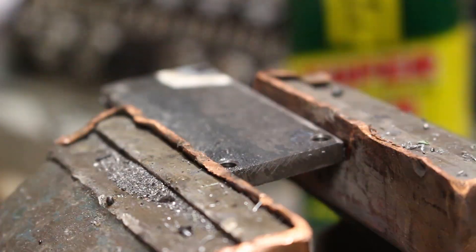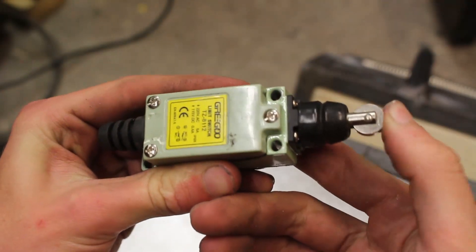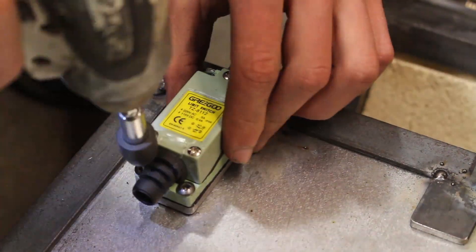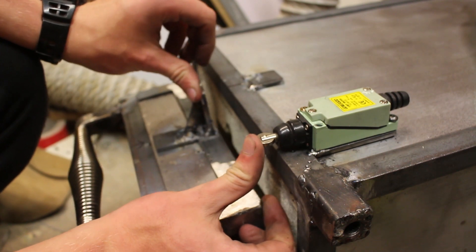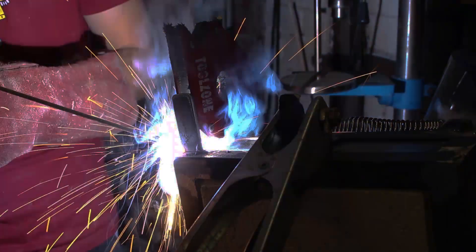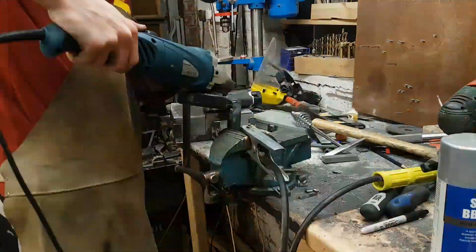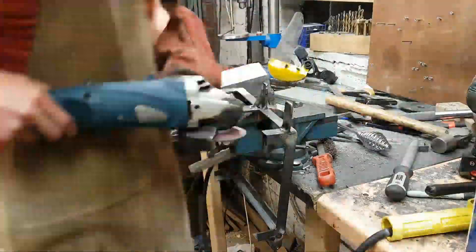I tap this piece of 5mm sheet steel with some M4 holes and weld that onto the side. This is actually going to be a bracket for a limit switch which is going to act as an interlock for the door, so that when the door is shut the power is on, and then when you open the door it turns off the power to the inside of the oven, lowering the risk of electrocution. The interlock just mounts on the side here and I need to weld on a piece of flat bar to actuate it when the door is shutting. I can then take all the parts of the door off and complete all of the tack welds, fill them in as normal welds and grind and file them down.